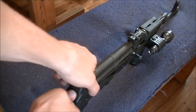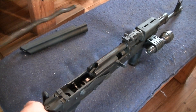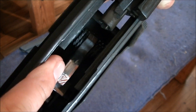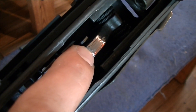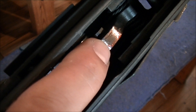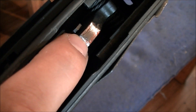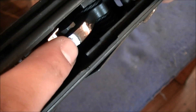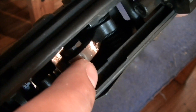Let me pop this thing apart here. This one's got the Tapco trigger. Right here on your trigger bar — the part that actually smacks the firing pin. This first little lump, right there at the tip of my fingernail, from here to there is where that bolt rides up on. When it gets to there, it wants to stop. Before I polished this, there was a little lip there. Where when the bolt came backwards this way, it was folding metal because this was such a sharp angle. Instead of rolling like it is now, it just came up and made — it was flat, a sharp edge there.